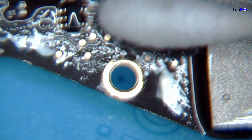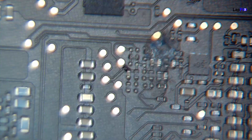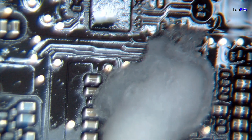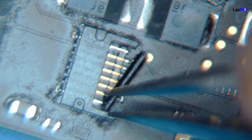We're going to start near the Wi-Fi chip — this is the U4800. Let's just do a little bit of a cleanup there. Using a Q-tip with some alcohol is really good, because what you don't want to do is knock any type of components, especially if there's any type of liquid damage. Using a brush or anything a little bit harder may actually do that. We're going to be doing that quite a bit here, because it doesn't look to be actually too bad — it's mostly just a surface-level type of corrosion. Nothing looks to be absolutely crazy. Here's the U7650 area — it's not too bad. We also used a little bit of hot air and flux, and we'll put it in an ultrasonic once we're all done.